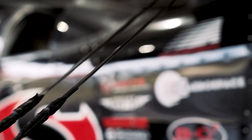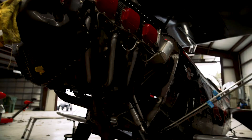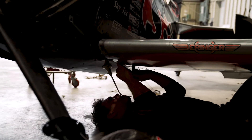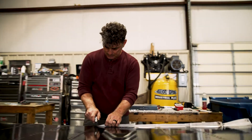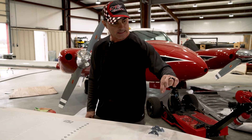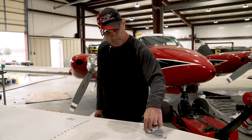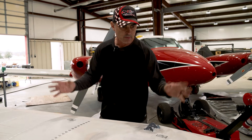Because of the damage to the top wing when we got home, I wanted to uncover the top wing and make sure there wasn't any other damage. This is the plate that we broke down in El Salvador — this part ripped completely off the airplane. The bolt was still on this plate, but it was bent back about an inch and had broken two of the five bolts that hold it on. So it was a pretty serious failure, which is why we went to all the trouble of pulling the fabric off and taking a look at it.